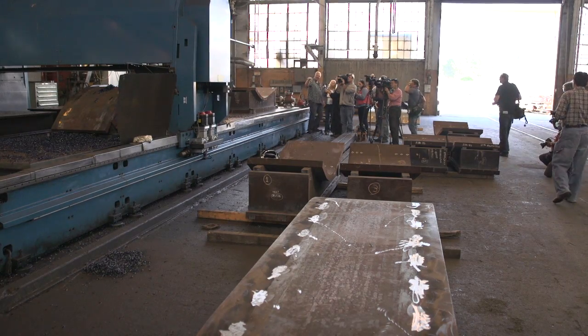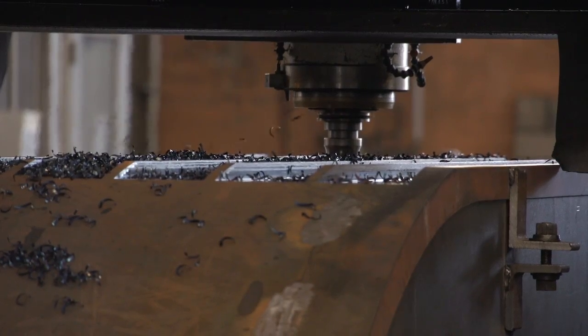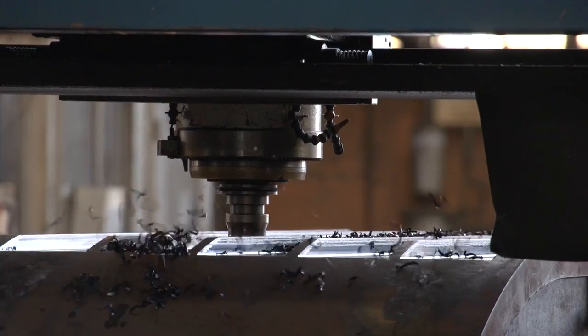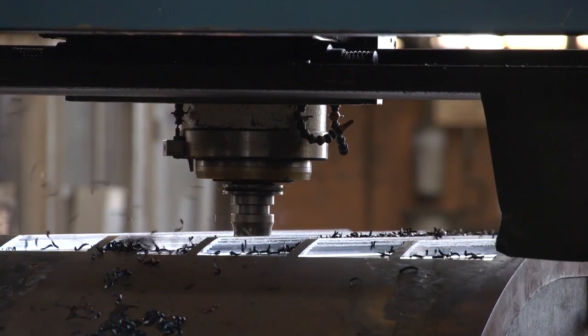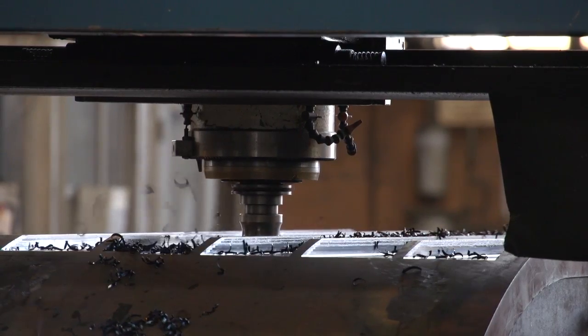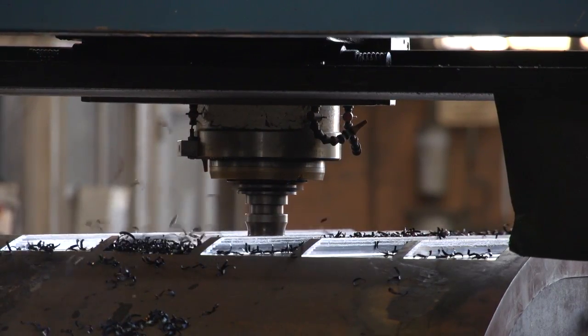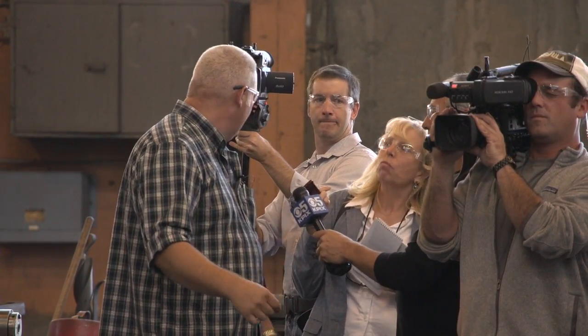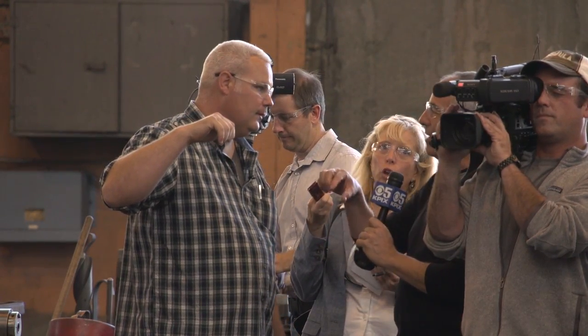They trough it out across — it's all CNC, computer numeric controlled. Once they're done troughing a certain section on the top, it'll come in and start individually cutting those 1⅛-inch steps within each trough section going down. That is where the tendon is going to lay in there and go across. There will be 27 tendons per each trough.